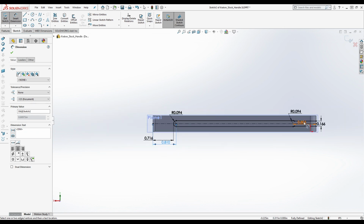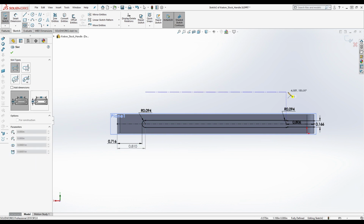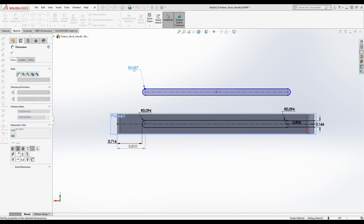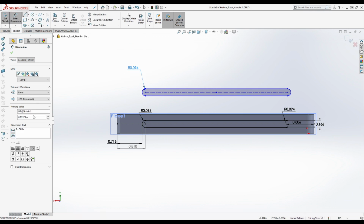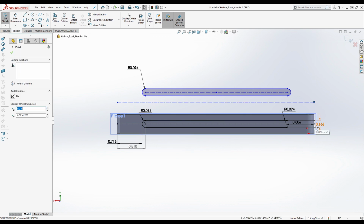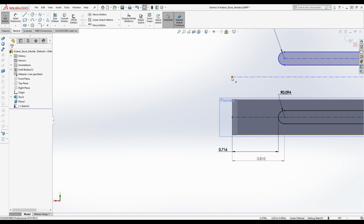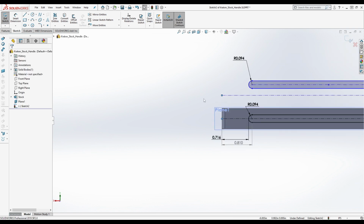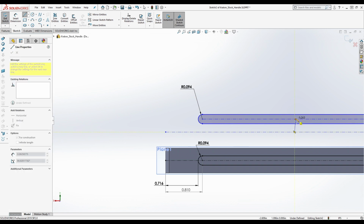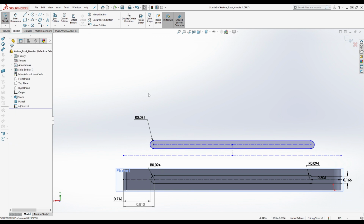But because these are so similar, it makes me think what he probably did here was use this tool right here. And what that would allow you to do is you would do something like this, okay? And then you would define this to be 3/32 radius, okay? And you would have a line. I'm just gonna show you above the knife right now so you guys can understand what I'm talking about here, right? So this point and this point, you're gonna have a vertical constraint, okay? And you're gonna have a vertical constraint between these points right here, okay? And then now you would be able to do this right on the line, okay? But we're gonna take the midpoint of this, and then we're gonna say this is vertical, which means that it's in line. And then you would pick a size of this slot.